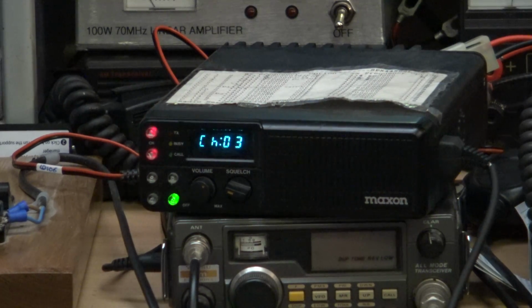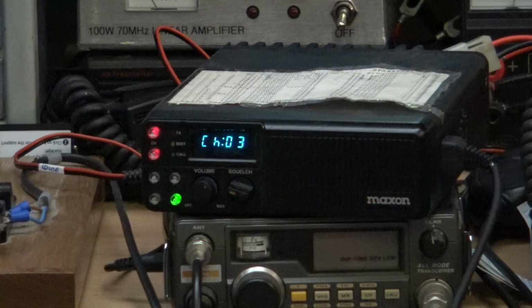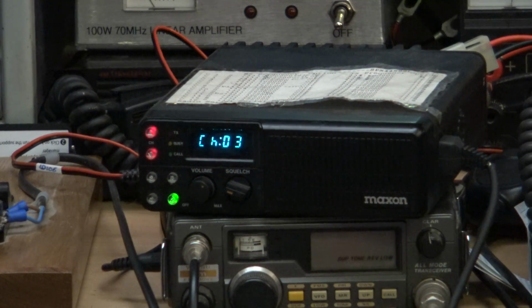So again, I did have to just pop the squelch down a fraction when I saw it open. Normally, he will use a 5/8 aerial on the car, and we'll get vastly improved performance. But this was to do it with a quarter wave aerial, so it was comparable with what we did with the PMR 446. I've spoken to him, he's been on 45 watts and I've been on 40.